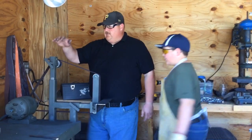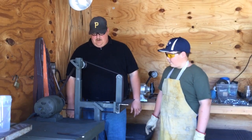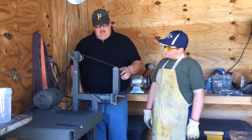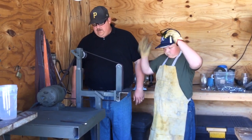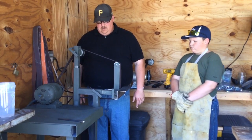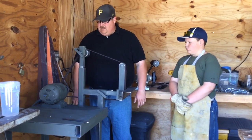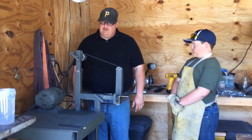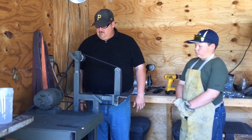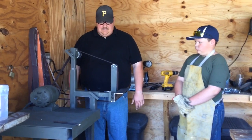Well, that's our project that we put together last week. What we have is just a few pieces of square tube that were scrapped around the shop here, and we purchased the wheels — the contact wheels, the tracking wheel, and the drive wheel — got them on eBay for about a hundred and five dollars. That was really the biggest cost, because the motor came out of an old table saw. It's recycled, turns about 3,450 RPM, and it's a three-quarter horsepower motor.